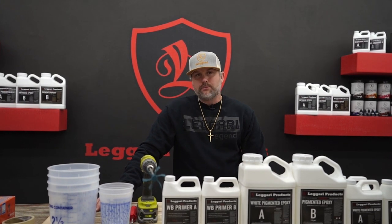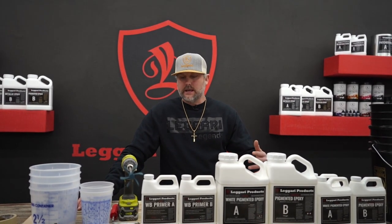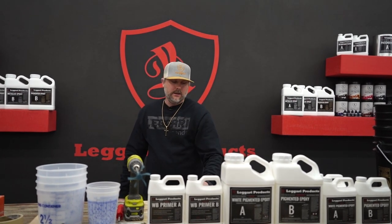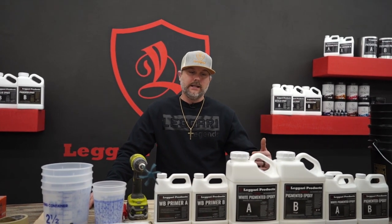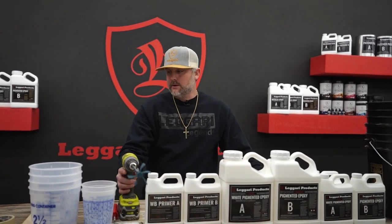And when we're doing a white primer over dark projects or dark counters or tables or whatever, we wanna make sure our edges are perfectly white, okay? So usually I like to do 2 coats over my edge so they're perfectly white. That way you can't see through the edges, because sometimes the resin doesn't go as thick on your edges and faces. So we'll get right to it here.